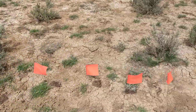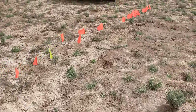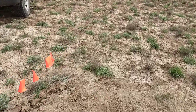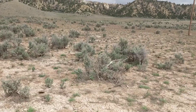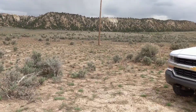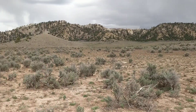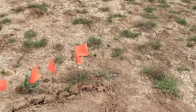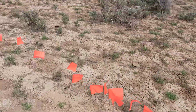So it's always a good thing to bore a hole in general if you're going to be digging a pond in a questionable area — or it's good to just do it in general. Frank Casals told me this: if you have an arroyo nearby where you're proposing your pond, go look at the arroyo and you'll be able to see the profile of the soil. And if it's 12 feet deep, then you won't have to bore a hole 12 feet deep.